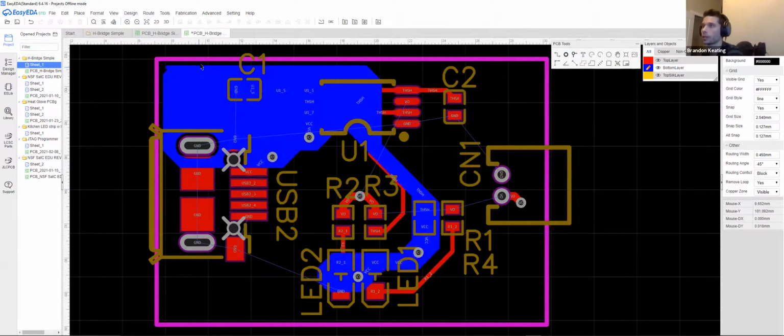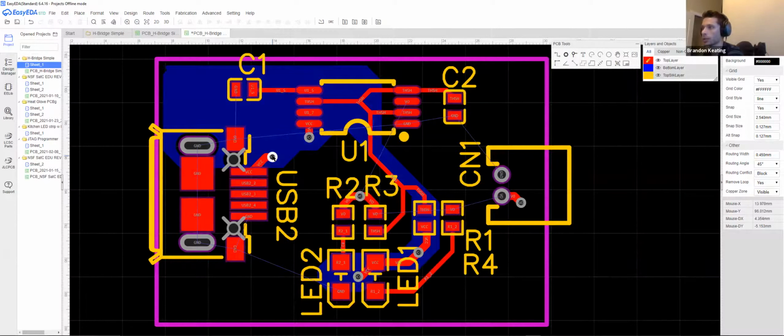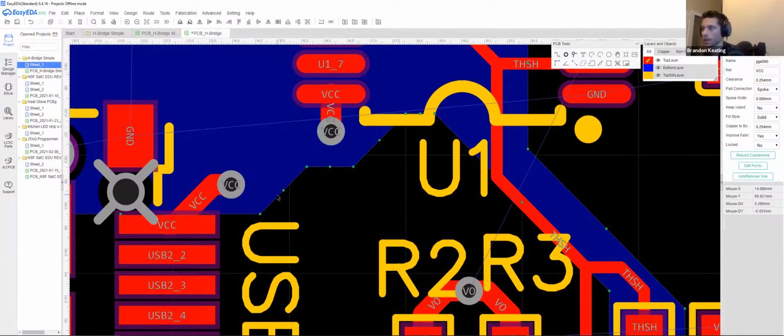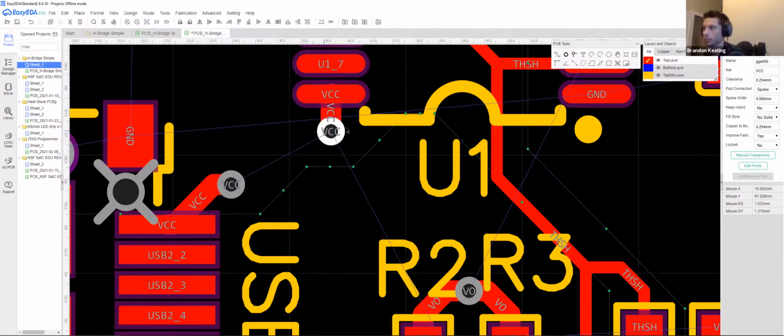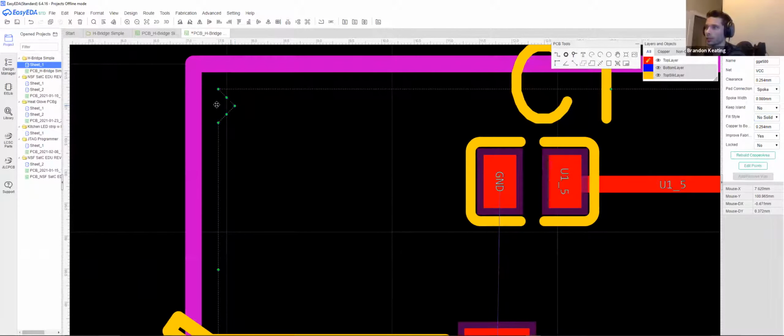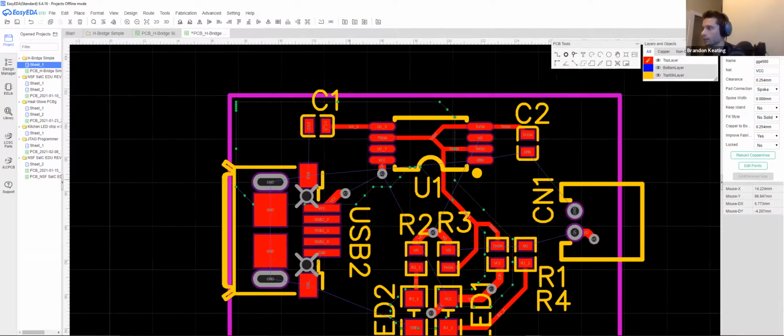And just like that. So see how this just filled in all solid, and now if I go up here, it's not telling me these lines are here anymore. So these two are now connected because they're going through this entire flat copper region. If I take this from solid to non-solid, now they're going to complain about how they need to be connected again. Also, while you're actually doing the PCB, it's generally good practice to just leave that kind of thing off.